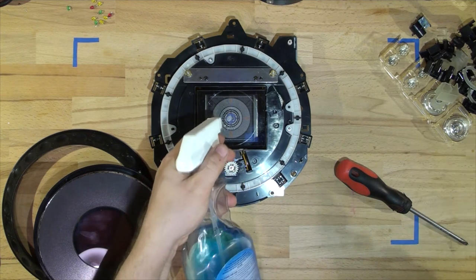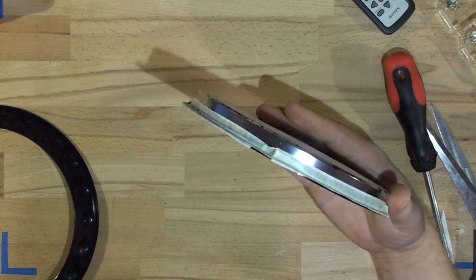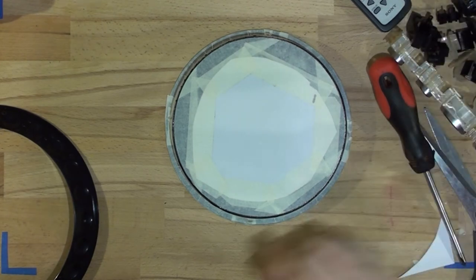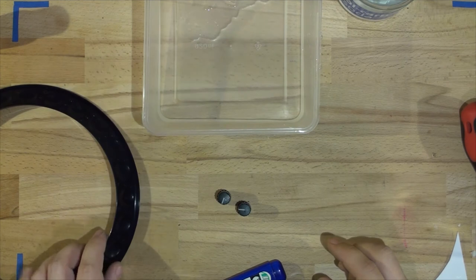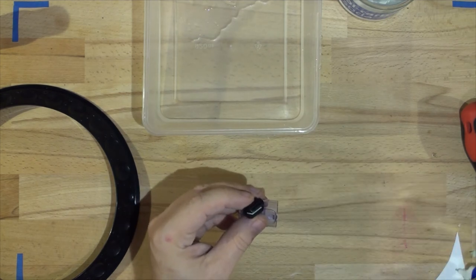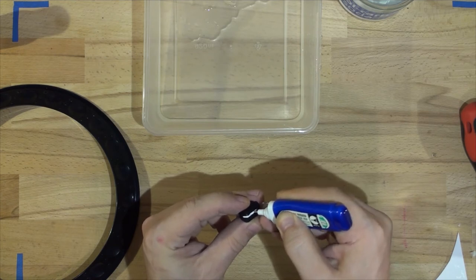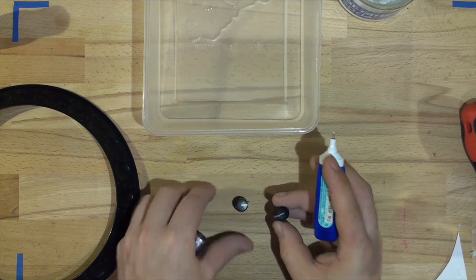I've masked off all the necessary bits to respray in that silver rim, so I'm going to go spray paint that, then take this to the sink and wash it with a toothbrush to get all the dirt and grime out. Before cleaning the disc ring of sticky residue, I'm going to show you another trick with those knobs — if you notice the white color is really dull. Simply grab the white-out that you use on paper, squeeze a little bit out, and apply it into the groove and wipe it all the way down.